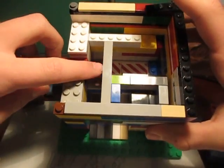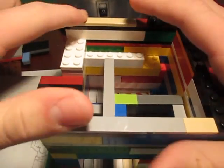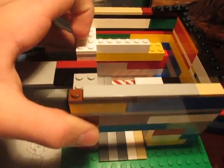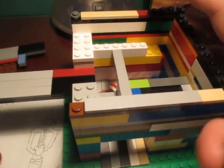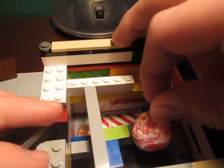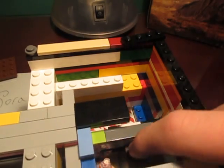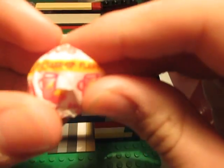The penny rides on this rail right here and pushes in. The penny is on this angle right here, and uses this ramp to be pushed down. If this ramp wasn't here, the penny would just fall into the candy slot. So the coin would push this lever back — a candy would be right here. The lever is here, which then pulls this arm back, and the candy's already fallen in. It pulls the arm back and the candy falls down into the hole. It's a bit quirky, but there are errors in everyone's machines.